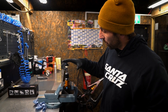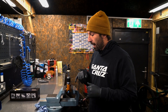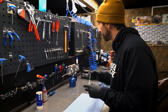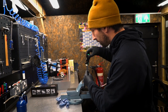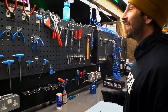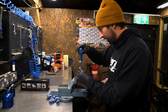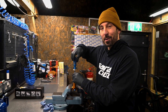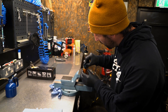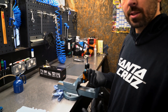We'll clamp that in. First things first, they are charged with nitrogen so we need to get the nitrogen pressure out of the bladder. We'll de-charge this now. There we go — that's now safe.